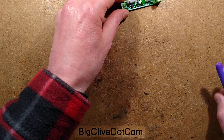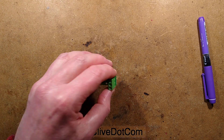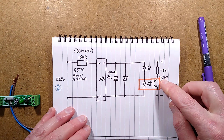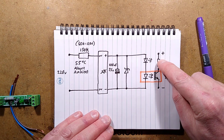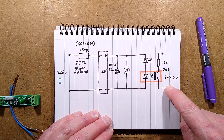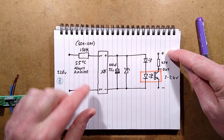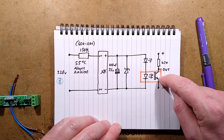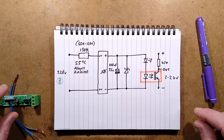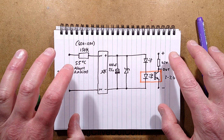It's a sensible enough design. There's also a pull-up resistor on the transistor that pulls up to the positive rail. If you want it to be a logic level you take that to 5 volts, this to 0 volts, and the resistor normally pulls it up to 5 volts. When enabled by the presence of mains voltage, the transistor turns on and pulls the output down to the 0 volt rail - so it goes from positive to negative. Effectively when the supply is there it puts out a logic 0, and when the supply is not there it puts out a logic 1.